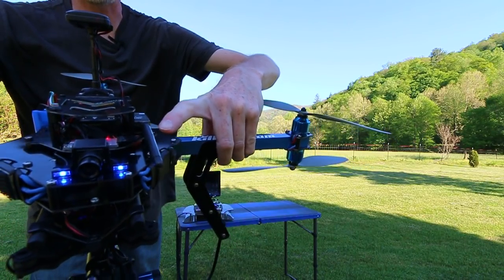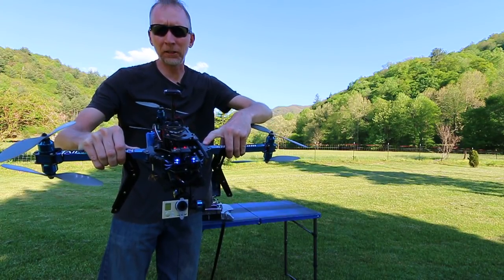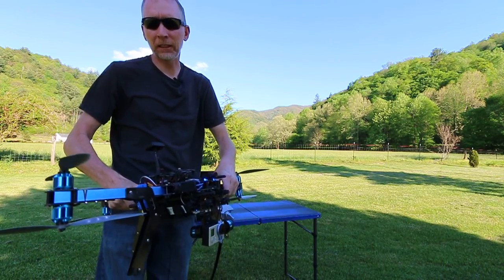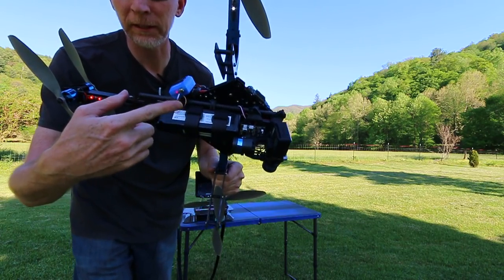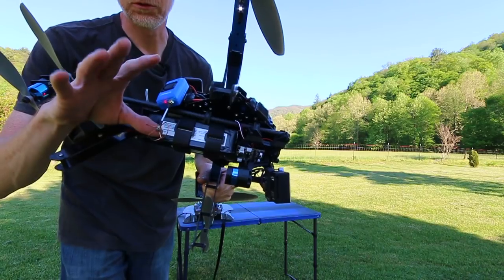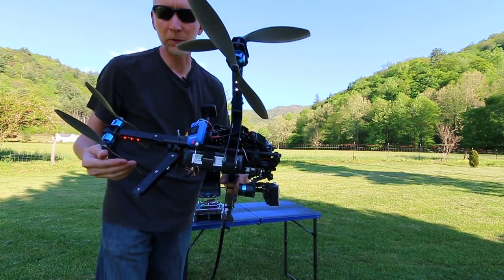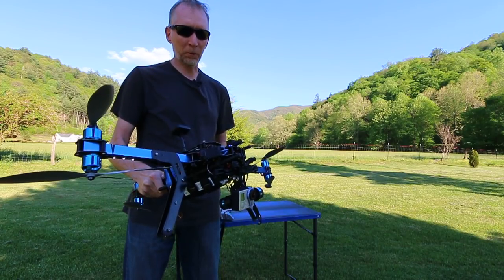And this antenna tends to broadcast in 360 degrees, total coverage, but it makes it a little bit weaker. This type of antenna is called a circular polarized antenna. It tends to direct more of the signal into a specific location. In this case, it's pointed downward, so it sends more of the signal down instead of spreading it all above the craft and everywhere that I probably won't be.